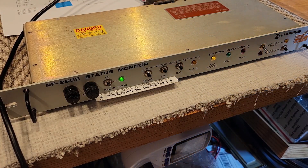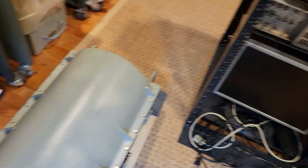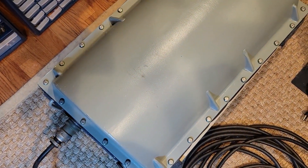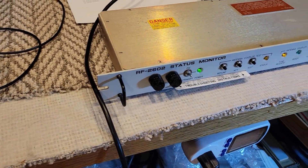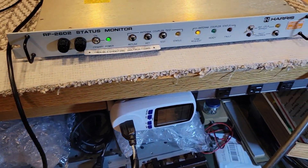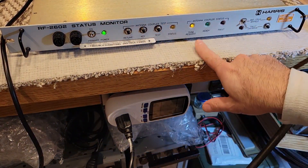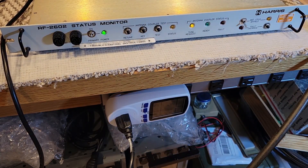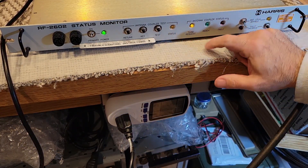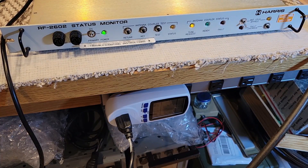Listen to this — I hope you can hear the coupler making noise. I can hear an internal fan switched on. I think you can hear a fan running. And what you'll see here — we've got power. And it's asking — this is tune request. It's asserting a line that goes to the transmitter saying give me some power so I can do a tune. We don't have the transmitter hooked up, but I think this is a good sign. I think that's normally what it's supposed to do.